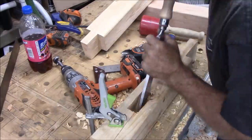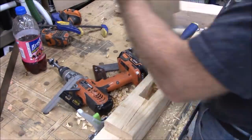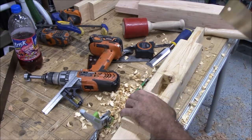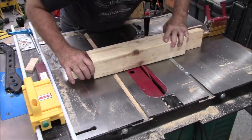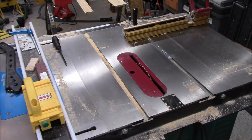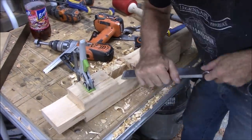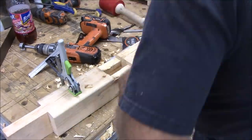Cleaned those out, got them down to the depth, and once they were all cleaned up and fitted well to the depth that I wanted, I scored them down and ran them back on the table saw — set at half an inch because they're set down half an inch inside. Then went back and cleaned that all up and slowly fitted each one.